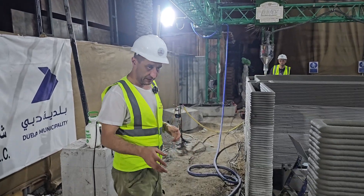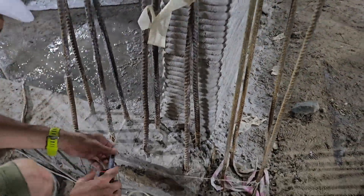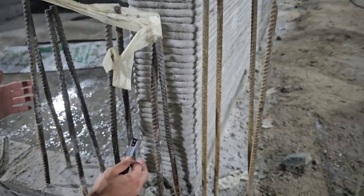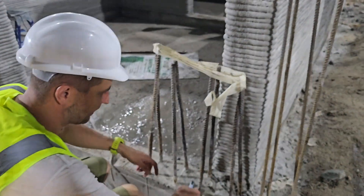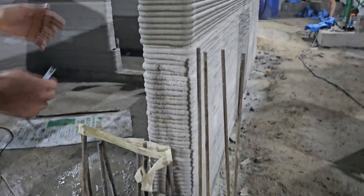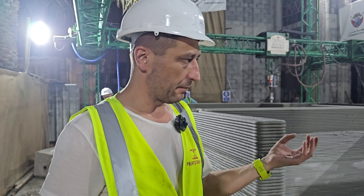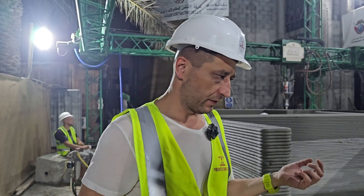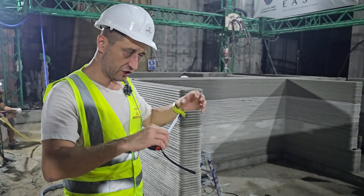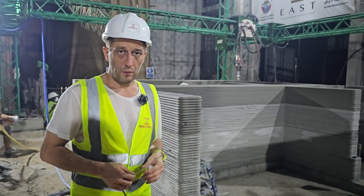The existing foundation was not enough for the printed layer — the layer width is 4 centimeters but we only have 3.2 centimeters available in some areas. All locations where reinforcement columns should stand have the same problem, so we're not printing formwork around the columns this time. It will be done conventionally using plywood shuttering and then cast. Other challenges included embedded rebars and conduits for wiring that were not exactly placed, since the foundation was not originally designed for 3D printing. We had to adjust the G-code based on the 3D model to match the real existing foundation.